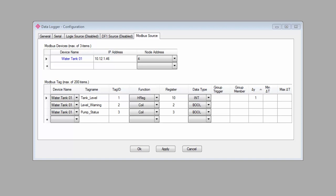If the variable that you're monitoring is something that changes rarely, or if it's a binary, you might just leave it at 1. But if it's something that changes often or is more volatile, you might want to increase it to 10 or 100 or whatever would be appropriate for your application so that you log data in meaningful chunks.